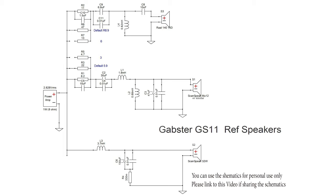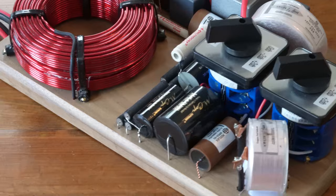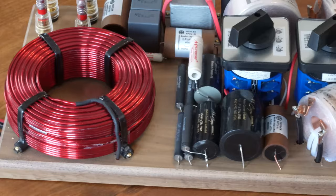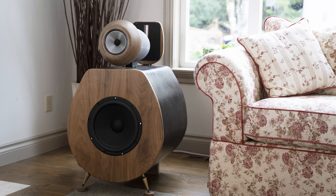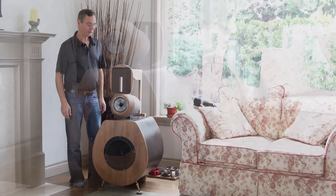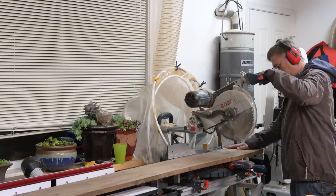It is a second-order crossover — keeping things simple is always best. There are a few resistors that attenuate or increase the midrange and tweeter level to accommodate the positioning of my speakers. Remember there are two configurations: one where the tweeter is behind the midrange — which is controversial — and the other where they are time-aligned.